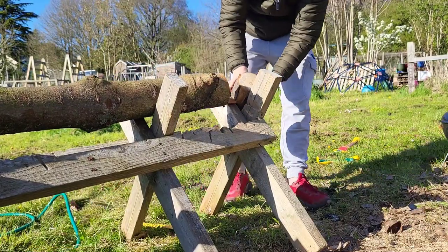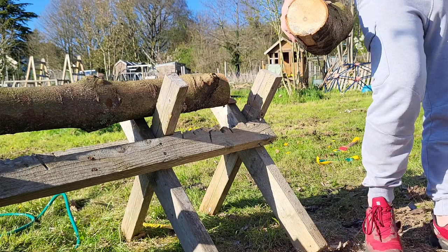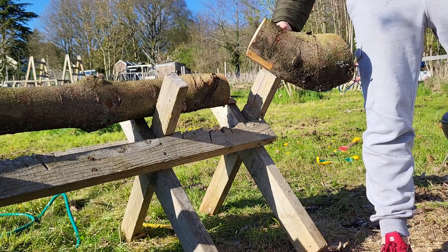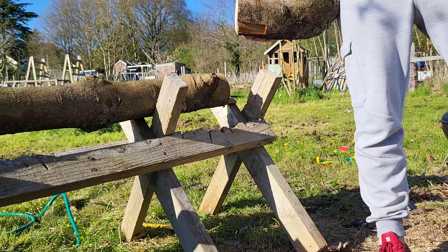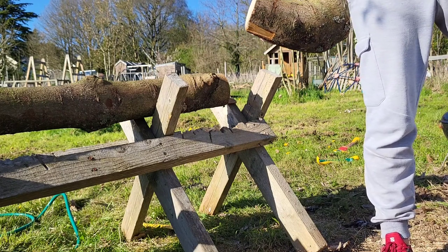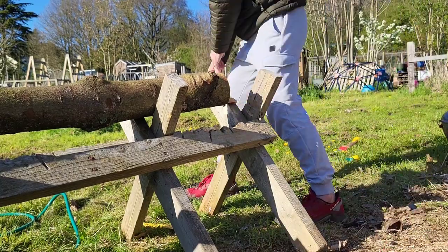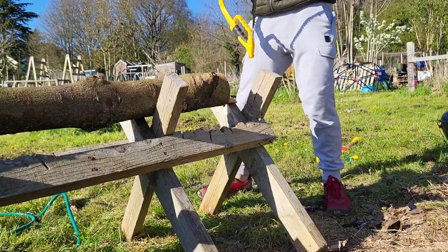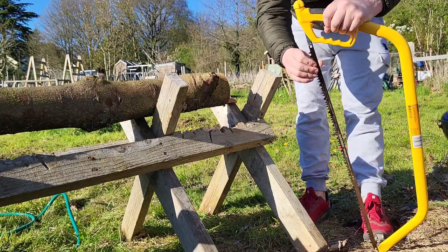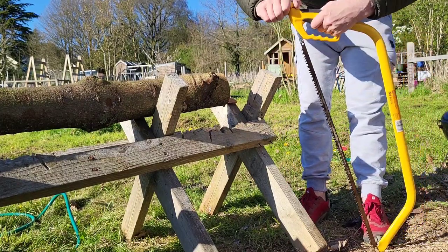So it's probably a good saw for that kind of size wood. It's nice dry wood, went through pretty easy — I could do that all day long to be honest, I don't really need a chainsaw for that. The last bit I showed you was probably a bit too big, but that felt a lot better. The blade wasn't deflecting as it was before, so it felt as good as my last saw. As you can see with these things, it's all about how much tension you can get on the blade.